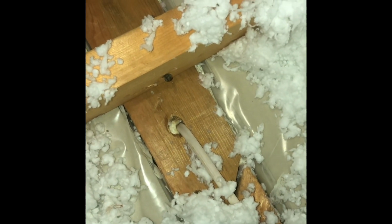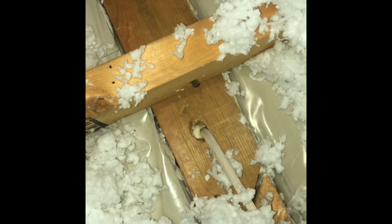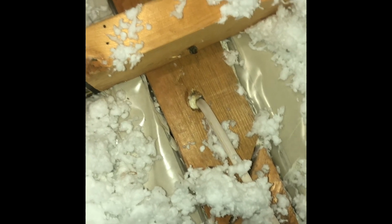No fun. So here's what I've got. So here's the existing wire going to that outlet that I want to tie into. Now, in this case, I found this just because I was able to get some reference points to where that room is to where the opening of my attic is. A lot of times what I've seen is people using piano wire to poke through the underside ceiling, because it's a super rigid but really small diameter wire, so that would stick up above the 2 feet of insulation that I've got here, and then I would be able to locate it pretty easily.